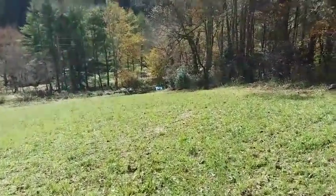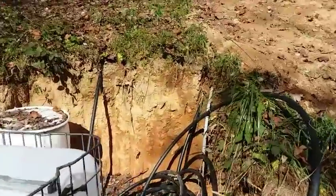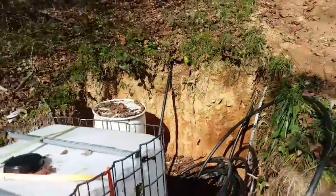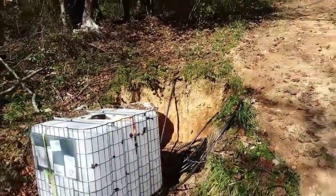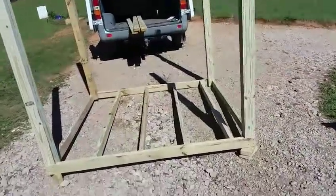Here is where I'm going to have my little cistern set up. The spring we tapped flows downhill through a one-inch pipe — it's going to go through a small filter and a float valve to my IBC tote, which will be my water reservoir. Here are my lines coming in: the spring coming in, electricity, and the line to go up the hill. In this little notch we've carved out, I'm going to fit in a little house. The building will protect it from freezing and sunlight — we don't want sunlight in there helping any algae grow.